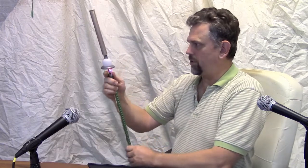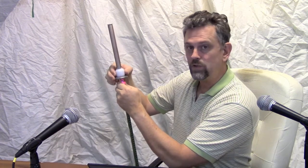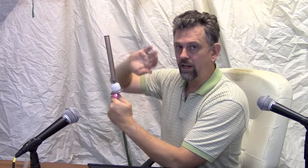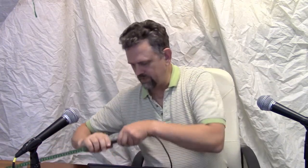The thing that's important in the deployment in the field is, of course, to put it down all the way and make sure that this one falls down on the holder tube by its own weight so it doesn't get stuck. Because if it gets stuck, the line will make a mess here and it will stop cleaning. It will keep measuring, but it will stop cleaning. Unplug it — remember, hold in the rubber, not in the polycarbonate. Plug in the blind plug, and we're done.